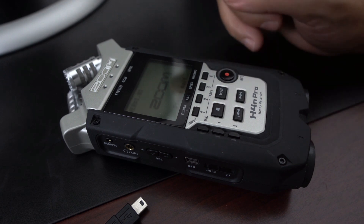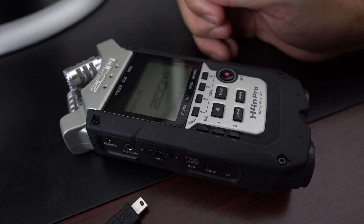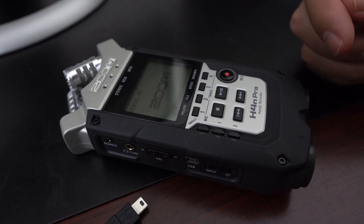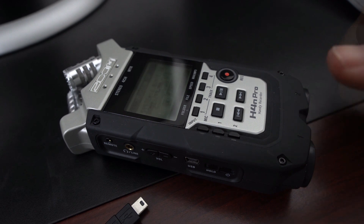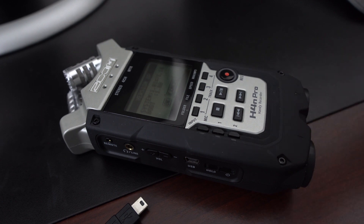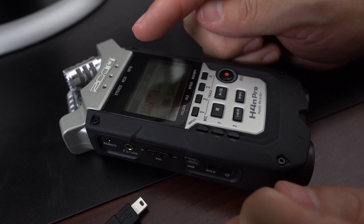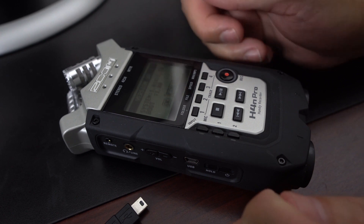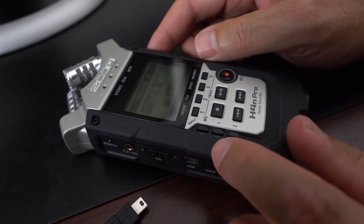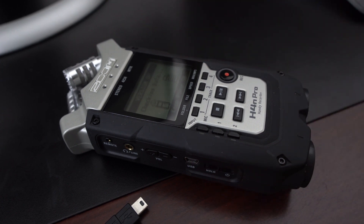What you want to do is press and hold the play button on the front and then power the unit on with your slide power button on the side. Press slide it on, press this button, and you wait. The boot sequence on the H4n Pro is not lightning speed for sure. One of the nice things I like about this Zoom is that I can use it as a USB sound card and the mic ports actually provide phantom power, so I can send 48 volt power to my condenser microphone right through the H4n Pro. We got the menu up and it's saying system 1.01 is going to be upgraded to 1.10. So I'm going to use the volume button to get to OK and press it in, and let it do its thing. It'll check the data and after it's verified that the bin file is actually from Zoom, it'll start installing the firmware.